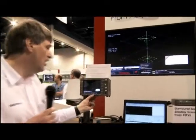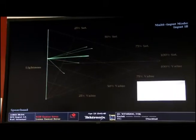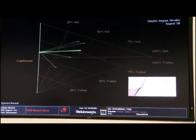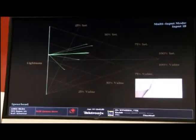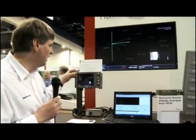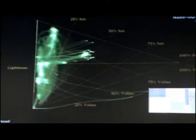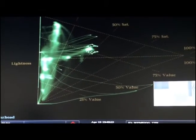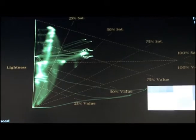Within the Option Prod, we've introduced a new spearhead display and luma-qualified vector displays that extend the gamut measurement and monitoring capabilities of the Waveform Monitor. This looks at the color space in lightness where RGB are equal, saturation and value of the signal, and we can make measurements within each of those particular pieces to color correct and adjust the signal to remove grayscale or to match saturation levels from one scene to another.